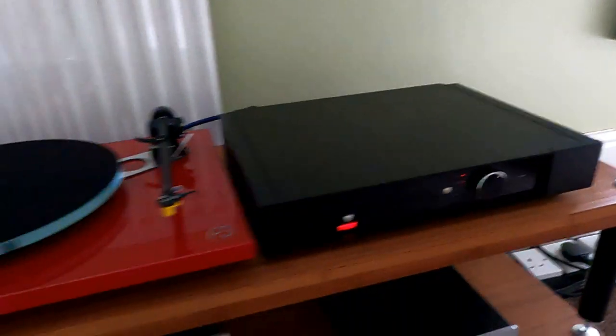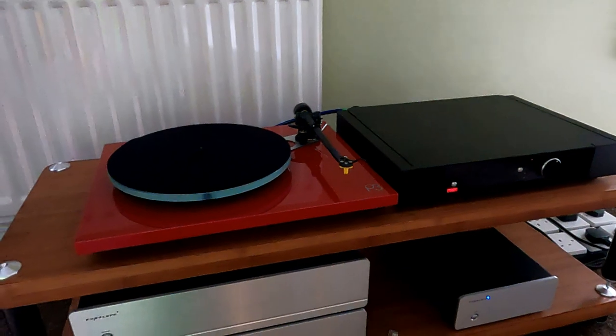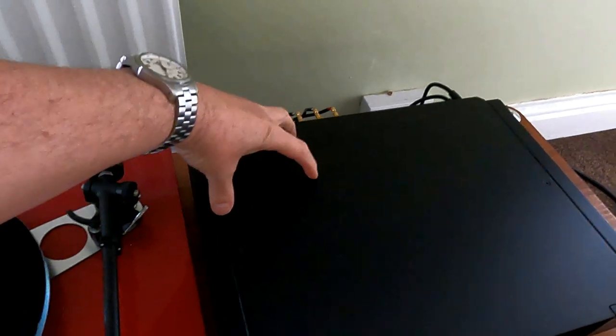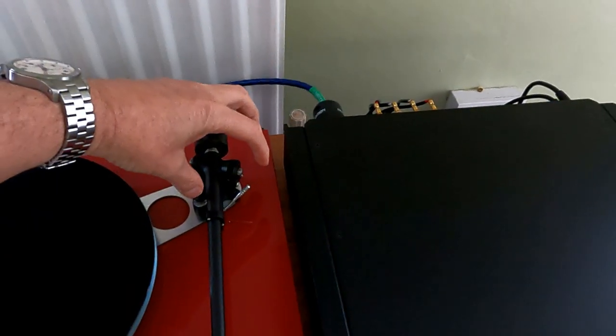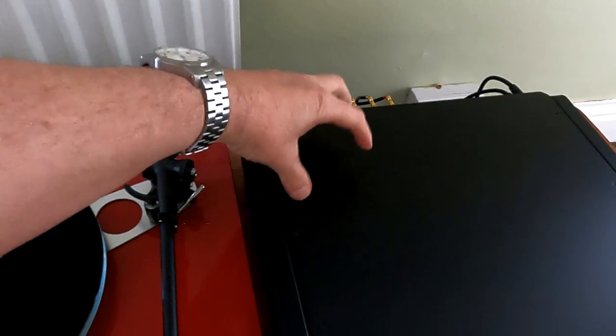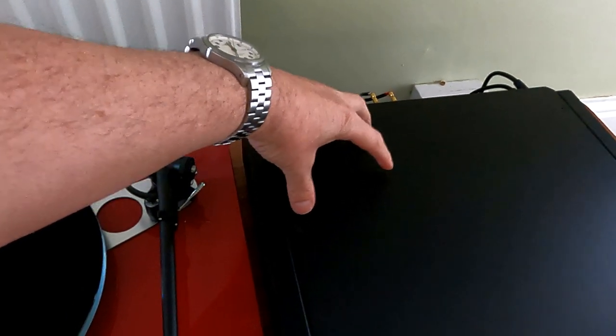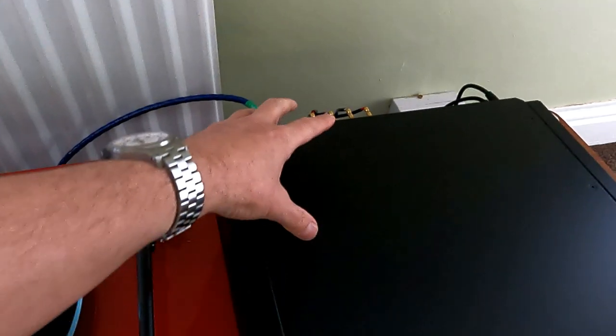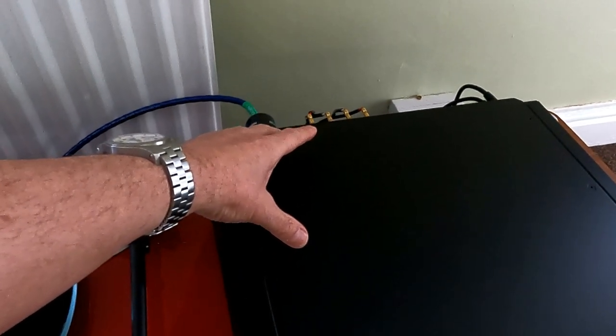And this is actually quite a simple fix, because this is a proximity effect. What we've done here is put the turntable on the left, amplifier on the right. In the amplifier, the transformer is here, and obviously the tone arm is here, arm leads and everything are all down this side. So the distance from here to here is really short. Transformers do kick out quite a lot of noise through the air and all over the place really. They're quite noisy devices, so you don't want one of those particularly close to anything.